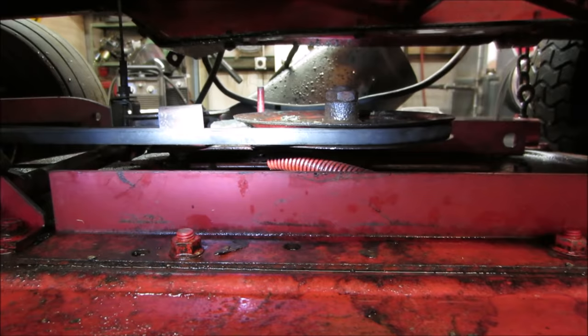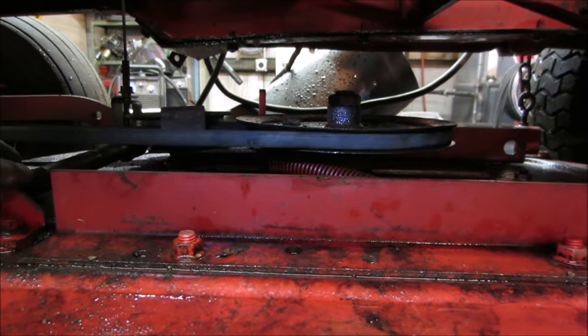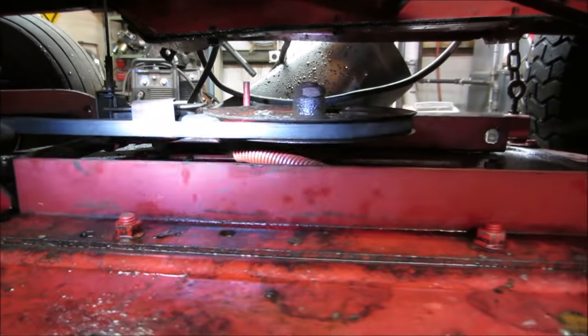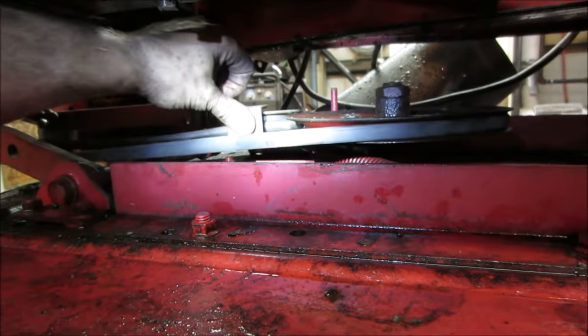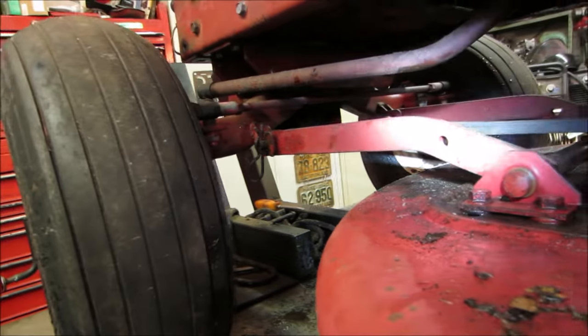And they're kind of tricky with that too. They screw with you. A lot of the companies will make a belt that's 103 9/16. So if you put 103 or 104 on, it doesn't work, or it doesn't work very well. It does kind of what I just talked about. So with these, with just a little preload, you probably got an inch, maybe either way, fine bit of play.